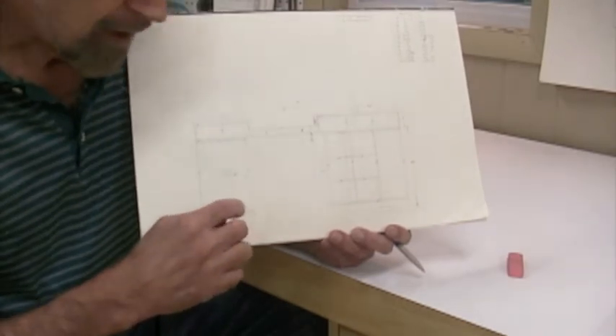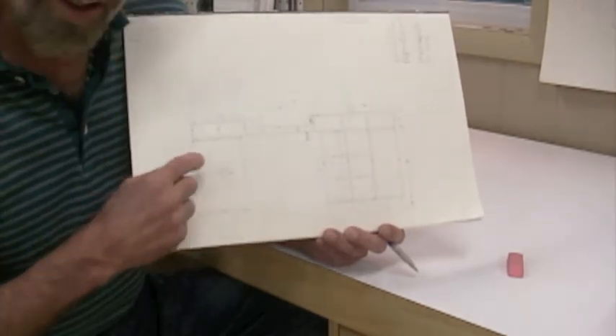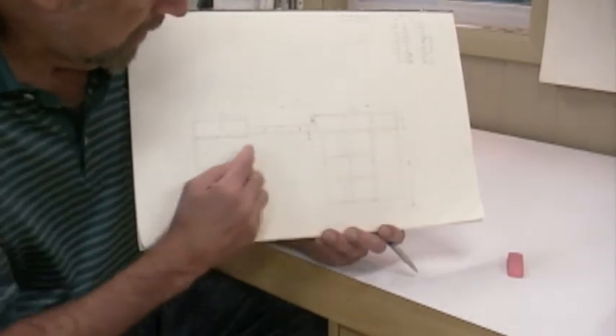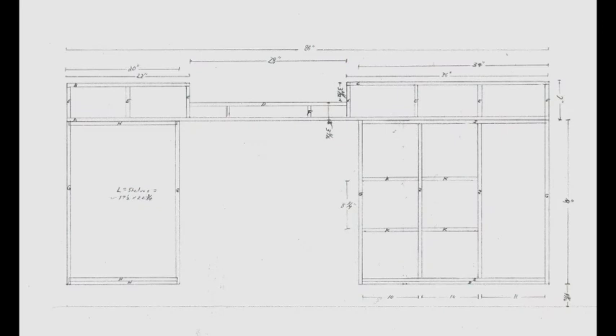You may notice that I've labeled all the parts. I don't always make cut lists, but for this project I wanted to be as efficient as possible with the use of plywood. The cut list is really more to help me figure out how much plywood to buy, and whether to get the store to make any cuts before I bring the plywood back to the shop. In the cut list, you'll notice that some of the measurements have a little squiggly line in front — to me that means: don't cut that piece until you're ready for it, so you can cut it to exact size.